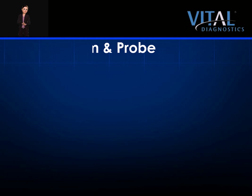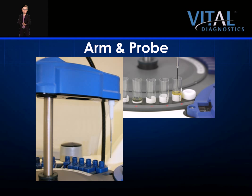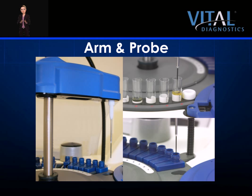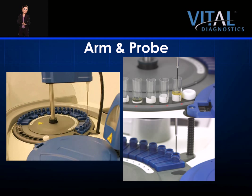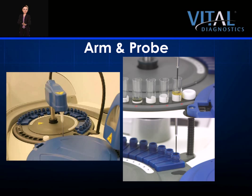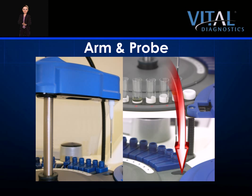The EON100 utilizes a single robust arm and probe for all of its pipetting needs. The unit features liquid level sensing, which is important in determining if a sample is adequately available and for the on-board reagent volume tracking feature. The probe is spring-loaded with a sensor that stops it when it meets an obstruction, preventing probe damage that could lead to downtime. The probe is Teflon coated, which helps prevent cross-contamination. The probe washes itself in a dedicated washing station. The Teflon tip and the probe washing station together eliminate the need for costly disposable pipette tips and decrease operator interaction.